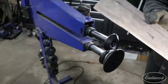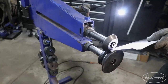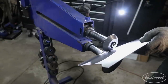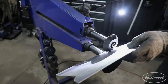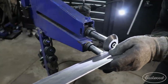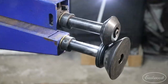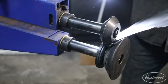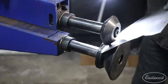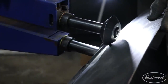I'm going to go another full rotation and follow this along. You'll start to see it's going to start bending it up quite a bit more in the second pass with one more crank of pressure on the bead roller. I'm not going to follow the corner - I'm just going to let it right off the edge here. Now I want a little bit more aggressive, so I turned it down about a crank and a half. Now we can start feeding this through and the bend is really going to start coming around on our hemmed edge. I'm just holding with one hand, keeping pressure in - once you start the tip it's a lot more simple.